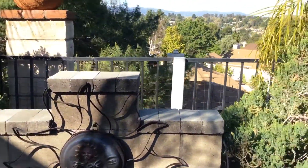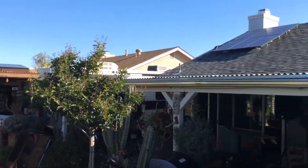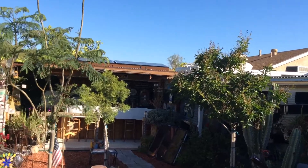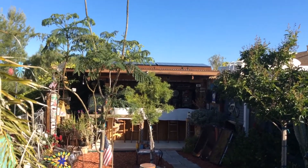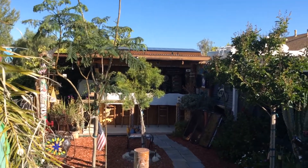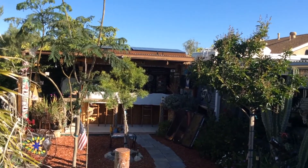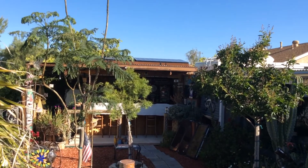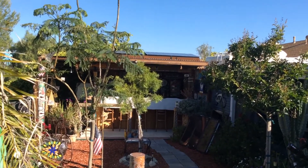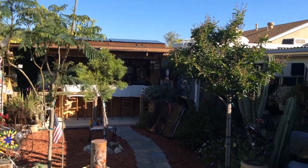This is where you see people making mistakes. My other array is up here, and over there is where my new array is for the 12 volt system. People get up in the morning, make coffee, do all this stuff, and now they have sunlight and they're powering everything. They don't have enough panels. You need to get enough solar to charge those batteries more than you're going to use.